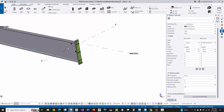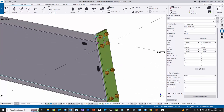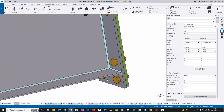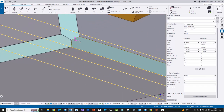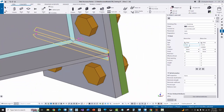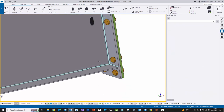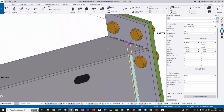We'll see that here in a second. When I come over to the right-hand side of the assembly, I've done a few different things as well. I have intentionally made a quarter-inch weld on one side and three-sixteenths on another — we're going to see exactly what happens with that. And here I've got a standard web weld near side, far side.